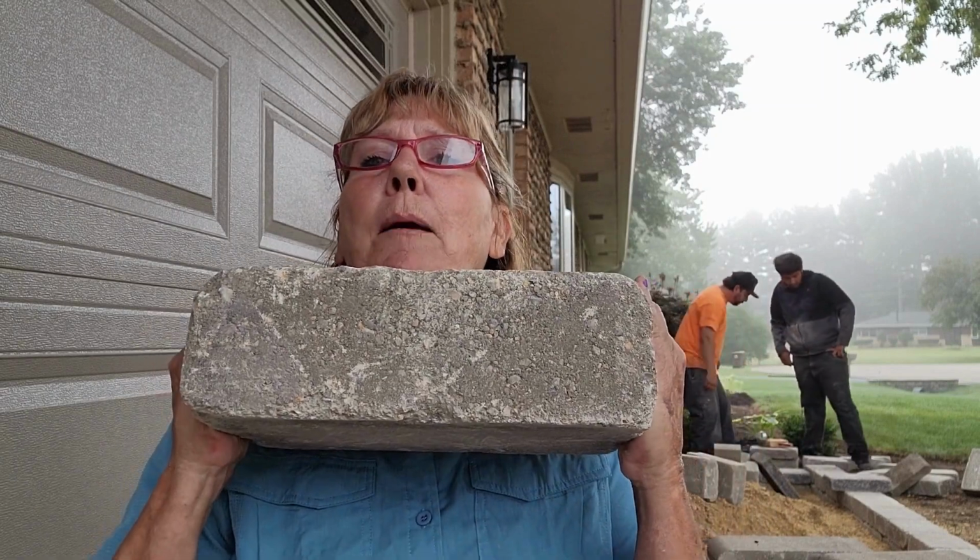Also, because this is a smooth brick, it doesn't have any grooves or edges or locking pieces to it, I can build this wall and not have to put a cap on it. Now, this isn't going to be for walls that are engineered and they're really high. I would say 2.5 feet, maybe 3 is about as high as you want to go with a brick like this. We glue them together as we go, and I use them a lot to make like little seat walls, to make like maybe edging walls, or a little wall to go underneath a patio to elevate it, or to make stoops and steps. So for me, this is great. We're using a sandstone color, and so Unilock Brussels dimensional wall, very heavy.